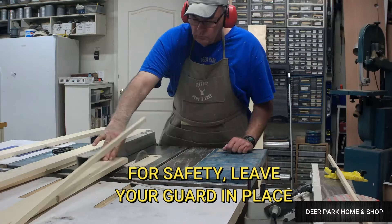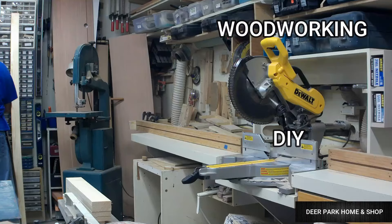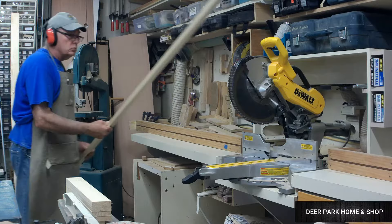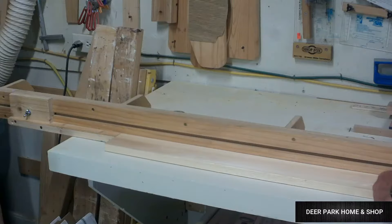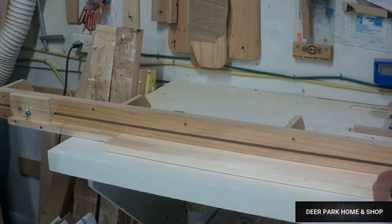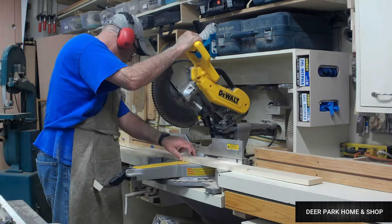Our first step is to cut our boards to the correct size. All of our boards for the rungs and for the sides will be 3 inches wide, so I'm going to rip all of my boards to that width. The ladder is right at 84 inches tall so I'm going to crosscut my sides to that length. I'm using a crosscut stop for all of my boards — this allows me to cut pieces to an exact length and duplicate it. The ladder rungs are 20 inches long. Make a squaring cut on one end, slide that against the stop, then cut the other end. Don't just assume that lumber from the lumber yard has square ends.